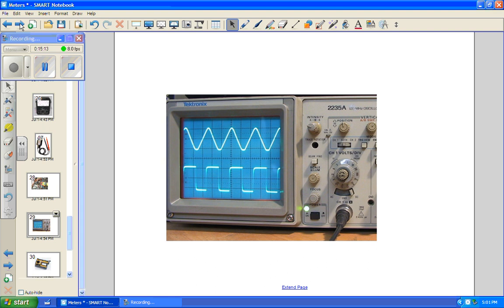This is the face of an oscilloscope. None of the waveforms shown are sine waves, which is what we expect with AC power. This is a square wave — DC power going on and off repeatedly. And this is a very modified sine wave, meaning something is very wrong with this voltage. An oscilloscope is basically a pictorial voltage meter; it shows you a picture of what the voltage is doing instantaneously over time, during one portion of a second.